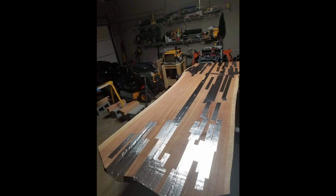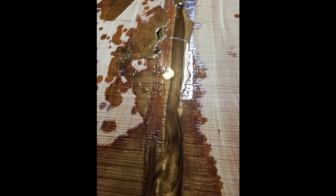Here I have the bottom of the table all taped up with aluminum duct tape — works really well for sealing up the cracks and crevices where the epoxy might flow through. I flip it over to the top side and start filling in with colored epoxy. I used Stone Coat Countertops cafe metallic, and it took several attempts — I would come back 30 minutes later and half the epoxy would have drained through into the wood. There were several hollow voids within the cedar slab which just ate up epoxy.